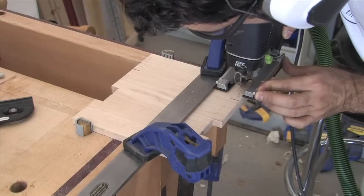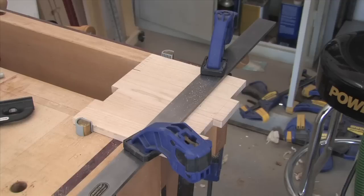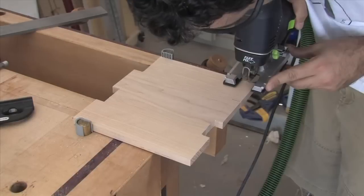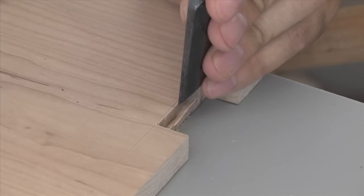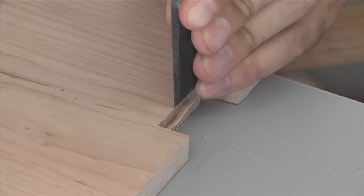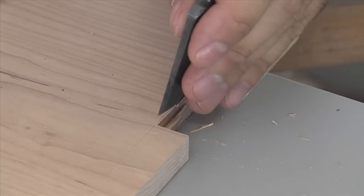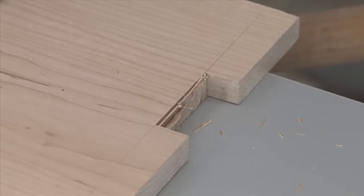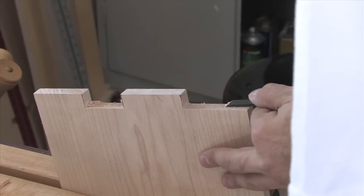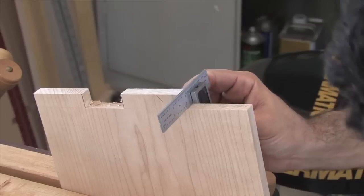In the article, Schwarz recommends measuring the base of the jigsaw and using a straight edge as a guide. Running a jigsaw along a straight edge has never really worked for me — my blade wandered and I had a little screw-up. So if you want my recommendation, take your time and go freehand. You can clean everything up with a chisel later on. To do the final cleanup on these joints, you'll need a nice sharp chisel. Clamp down the board on a sacrificial surface and chisel away the excess. Once you have as much removed as possible, rest the chisel on the score line and chop down firmly — just don't go more than halfway. Flip the board over and repeat the process on the other side. Once both sides are cleaned up, use a small chisel to pare away any remaining stock in the middle. It's a good idea to check your progress with a square.